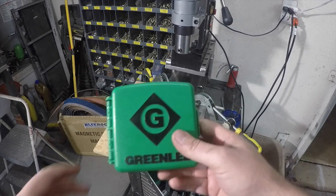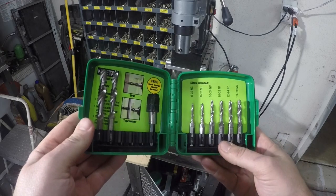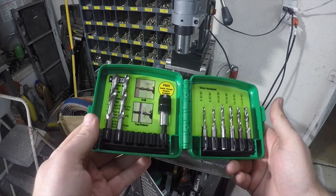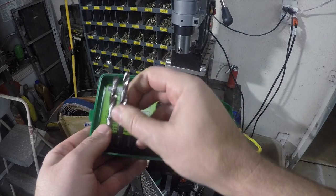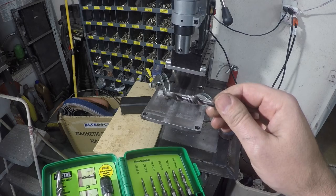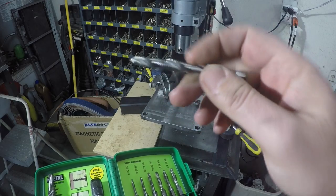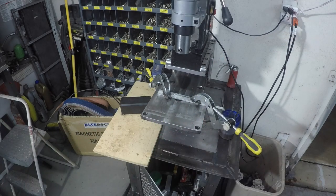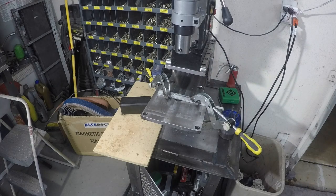The last thing, which should be the fastest, is this combo drill-tap tool. I bought these a little while back off Amazon — about $45 to $50 for the set, 6-32 through quarter-inch. I added a couple of extra ones, but there's a 5/16ths tap in this as well so it's the same size. This thing has the drill and the tap built into one — you can see the tapping part there. The only downside is the maximum thickness you can tap is quarter-inch, which is what we have here.